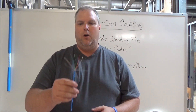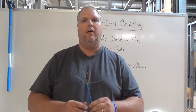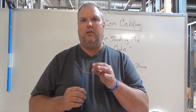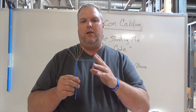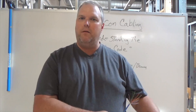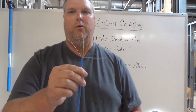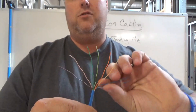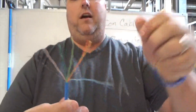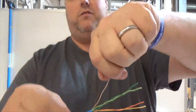There are two things that you should remember. When looking at a cable like this for a phone line — and this is what we're pulling in residential dwellings — your whites are always going to be your tip and your solid color is always going to be your ring. The whites are going to be our tip colors because that's our lead color, and that's going to make more sense when we talk about the 25 pair cable. So basically all we need to know is we're dealing with the blue and white pair, the orange and white pair, the green pair, and the brown and white pair.